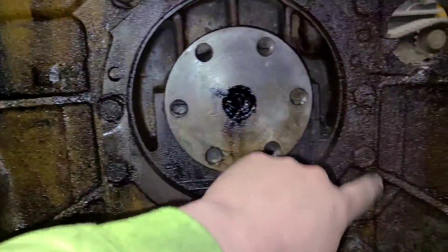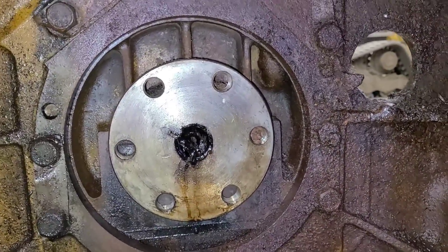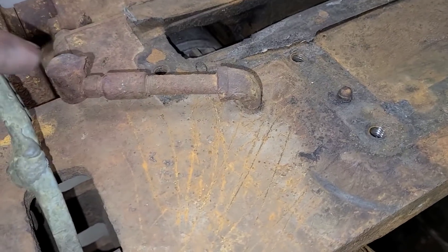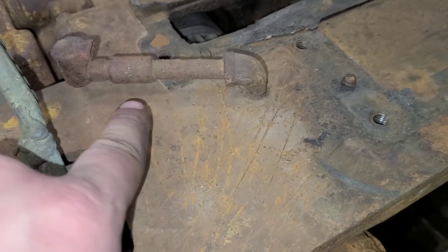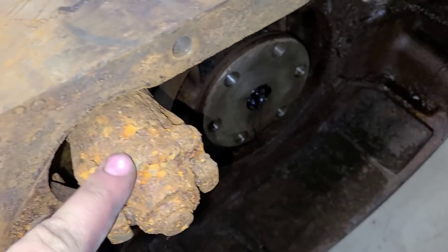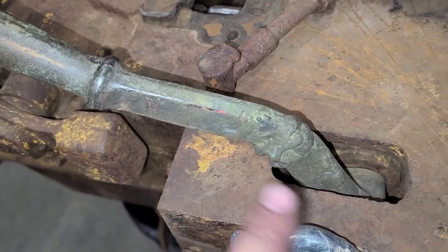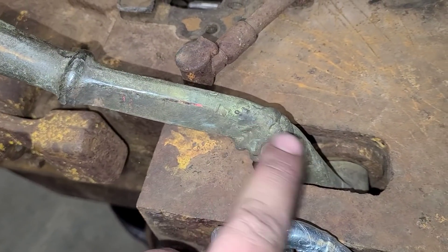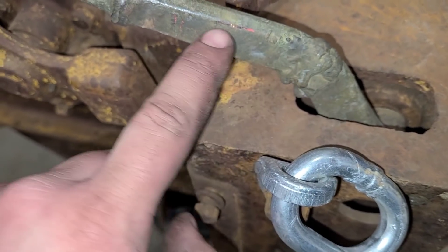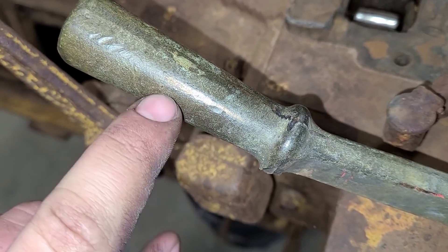With all that done, I think we can go after these fold-over locks. Did find a timing pointer in there — you couldn't see that before, it was so buried. Out here I noticed, which I haven't noticed before — Squatch would recognize that as the oiler for your starting pinion. I do have a question for Squatch as to what this lever is made out of, because they welded it at one time. I don't know if that is a bronze lever — it's kind of what it looks like up here.